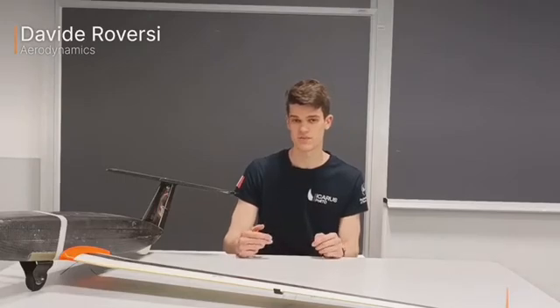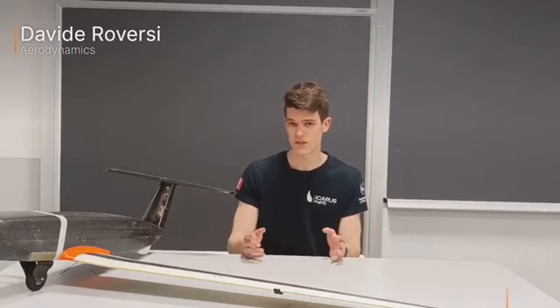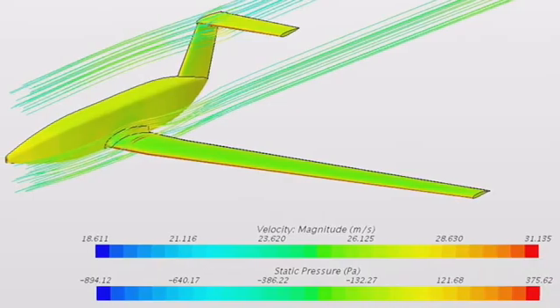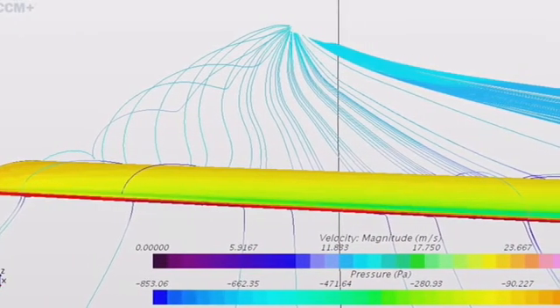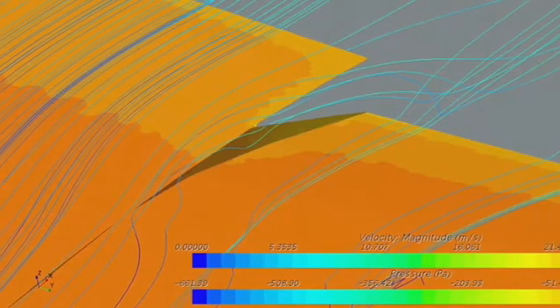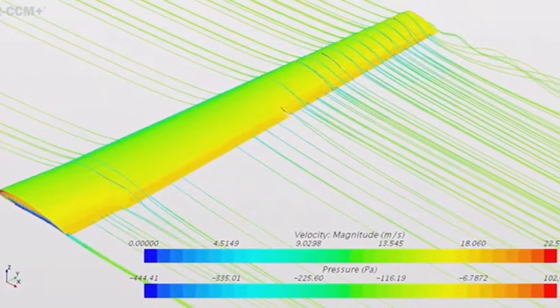The aspects that we focused on were two: first, we wanted to maximize the wingspan and the aspect ratio; and second, we wanted to have two semi-wings that would fit into the transportation box without additional sectionings. As a consequence, a simple trapezoidal shape was chosen for manufacturability reasons. The airfoil is a custom one, based on the AH family. The most peculiar aspect of our wing, though, is the dihedral, which was chosen to be a positive three degrees on each semi-wing to improve lateral stability. The dihedral does not start at the root of the wing, but about 18 cm away from the fuselage axis, in order for the wing-fuselage junction to provide better stiffness and strength.